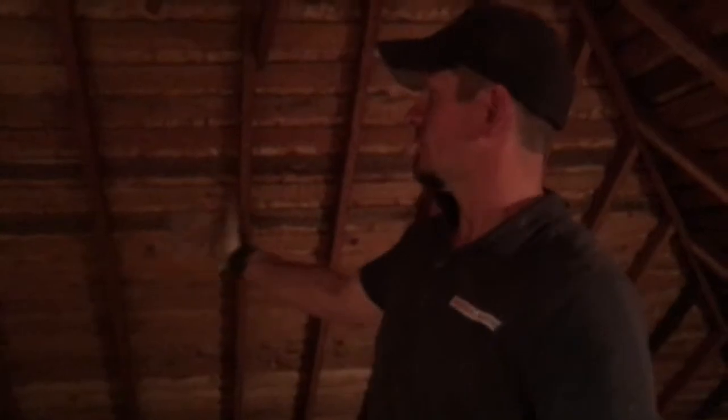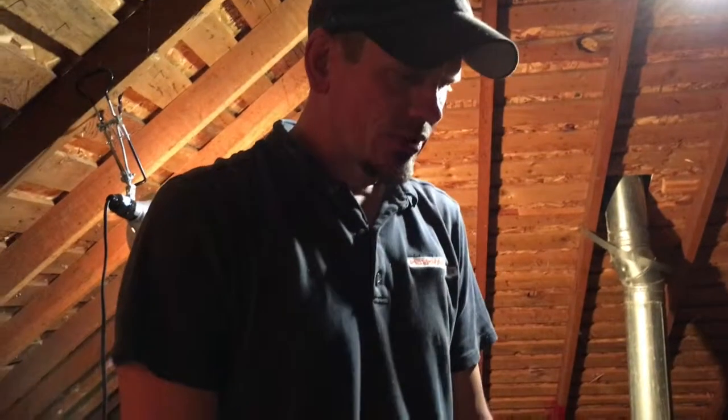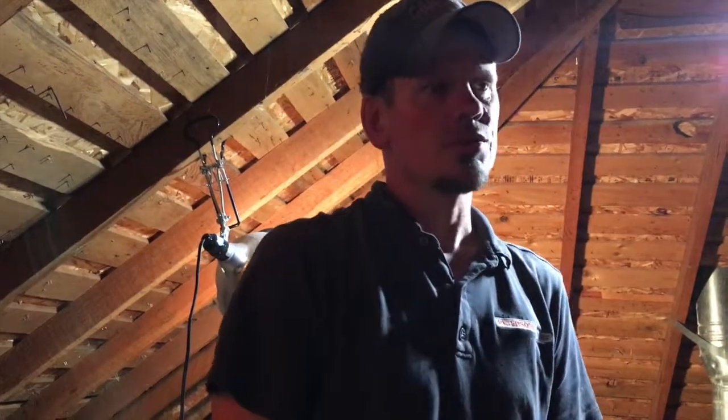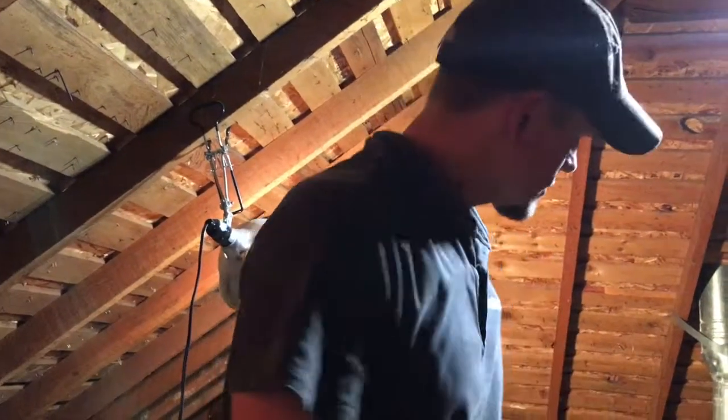So yes, there is a way to do this without trying to gut all the lath and plaster, but some homes have to. Look at this attic — the pitch on it's a 45. A lot of my older bungalows can have like a 20-degree pitch, and for almost literally 10 feet from this edge we can't get back in there if there's fixtures or outlets in the back; they'll have to come from below. And if you can't get below because it's a finished basement, there's really no way to do that. Sometimes you can go on the outside of the brick, but I believe it's in Article 250 and also under 300 — protecting your EGC grounding conductor — that if it's smaller than a number six and it's exposed to physical damage, you can't just leave it exposed. This can be exposed; it's not exposed to physical damage, nobody's going to get up here. The conduit runs surface mount down in the closet. Hopefully it'll help you out, thanks.